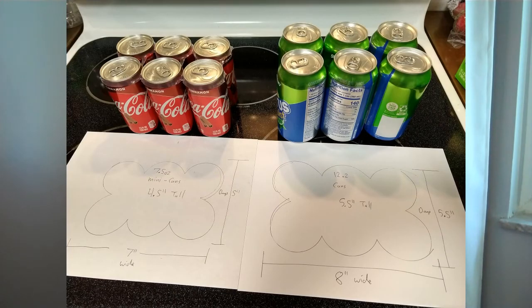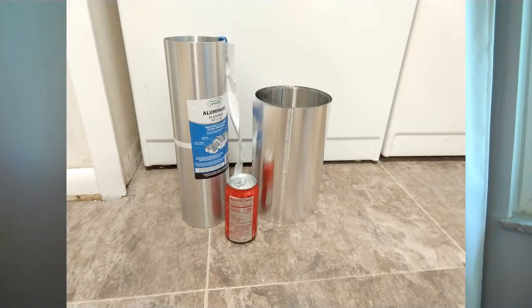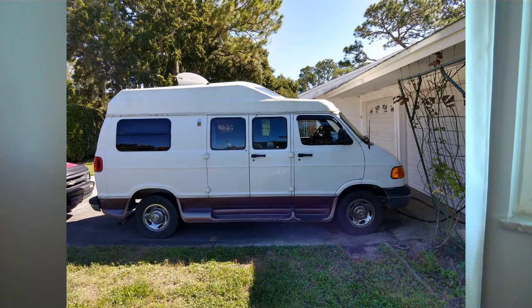I'm using aluminum flashing and I sized this unit to fit a six-pack of cans — that's why I got eight inches by six inches on the inside. I decided to go with a regular 12-ounce six-pack rather than mini cans. The height I went a little overboard on. The aluminum roofing flashing comes in 10-inch or 14-inch heights; the 14-inch was way too tall, so I used 10 inches. I could go down to six inches if I wanted to make it a lot smaller.